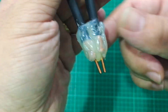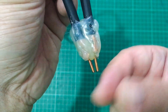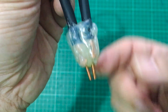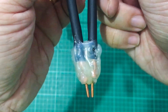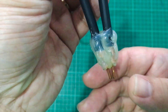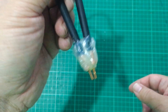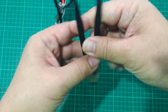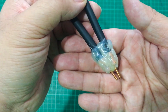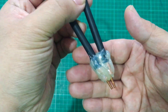I've made a holder for my welding needles by using hot glue — positioning my two needles together and applying hot glue all over. I've made it so that the pins are at the right distance I need them to be, but it's still a little flexible so I can make them wider or narrower easily. This makes it a lot easier — I can do spot welding using just one hand, and it really does make positioning much faster. I was initially thinking of creating a 3D printed mount, but hot glue does the job — probably even better than a TPU mount.